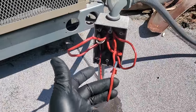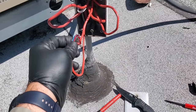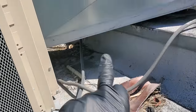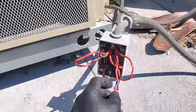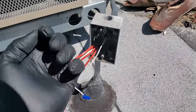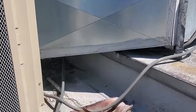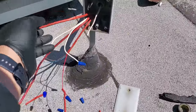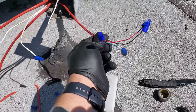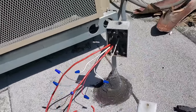Once I identified which ones are which, I pulled away from there and am identifying them in this junction box. I'm going to cut them and wire-nut them so I can run a new wire directly into the RTU duct detector. I completely disconnected the other detector. Also, this speaker wire enunciator wire wasn't going to anything — I traced it all the way over to the old fire alarm enunciator on the outside of the building; it was just the audible speaker lying on the ground, so I disconnected it. In its simplest terms: you have one jacket going to the fire alarm panel and one jacket going to each test and reset station — that's all we've got.